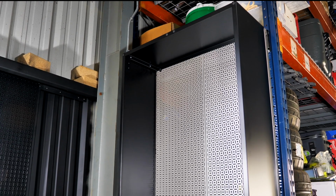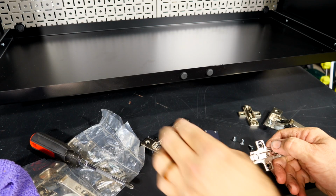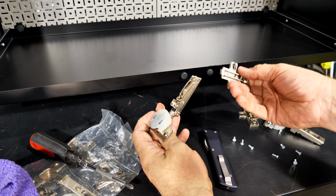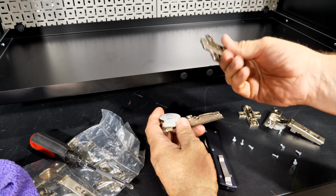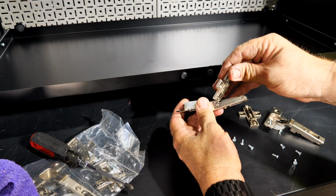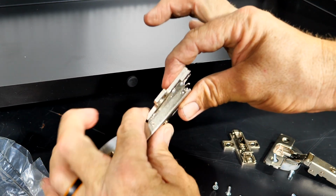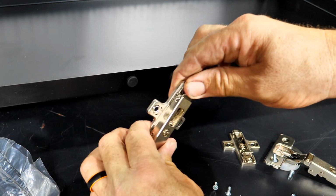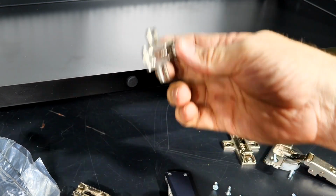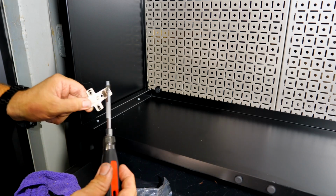Okay, now all the sides and the top and the bottom and all the clips and the screws and the bump stops are in. It's time to put on the doors. Now this makes it rather easy because your higher end cabinet hardware uses the same stuff. You may see this in your kitchen, and it's a two-piece design. So we can mount this to the actual cabinet body, and we can mount this to the actual doors, so we don't have to hold the doors in place while we hang these. These two pins right here slide into place, and then you'll see a clip right there. Now that's locked into place, but just push this lever and then you can pry that away, and now they're two separate pieces again. This will mount on the cabinet, and this tongue that depresses will face the back of the cabinet. And the screws are included with these.